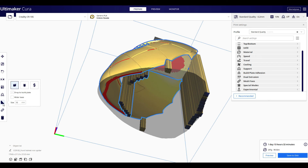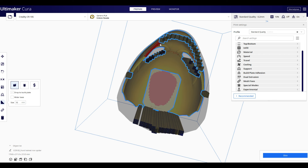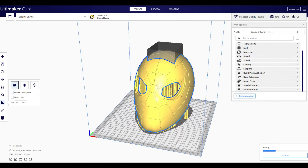We're going to put some supports just right under the chin — let me go 10 millimeters on those. Because I clicked no supports and I'm putting in manual supports, I really need to do that here, otherwise we're going to have a failed print. That looks perfect, so we re-slice. Always re-slice — you never know what you're going to get in that software. You want to make sure everything looks good.